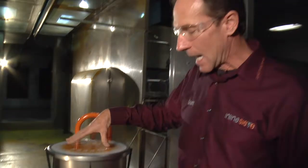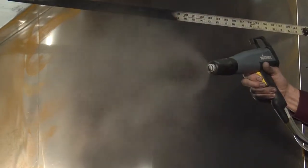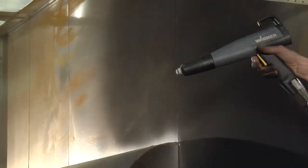One thing we're learning about with the airless hopper is we have a very high density cloud coming out. We're pulling powder from a raw state, delivering it to the gun at much higher density.